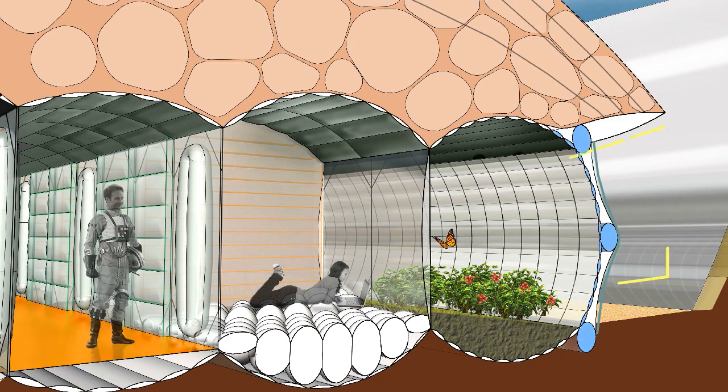The transparent sidewall consists of four layers. The inner two layers are divided into cells as well. The space in between is filled with carbon dioxide to reflect infrared radiation that comes from the inside. A net of parallel dyneema ropes reinforces the membrane. The pressure from inside the membrane is 50 kN per square meter, which is equal to the weight of 5,000 kg on Earth.